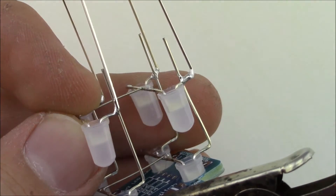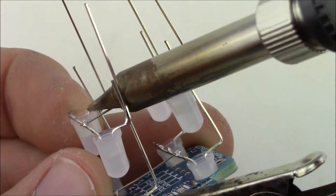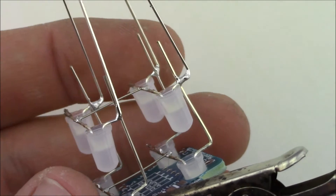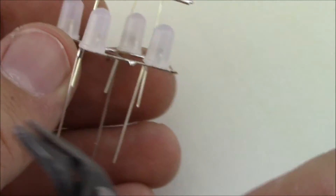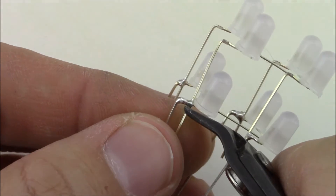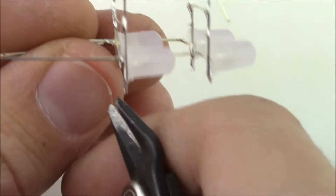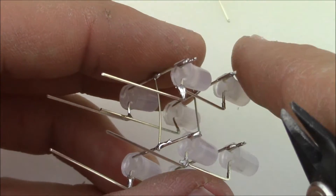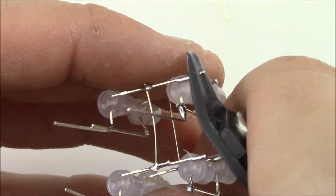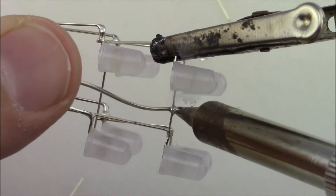Do that for all four LEDs — here are the front two done and the back two being soldered. It's a little finicky but not hard. Once four solder connections are made, if it's crooked you can heat up the solder and bend the LEDs to straighten them. Now trim off the little soldered bits with flush cutters, keeping the long leads intact since those solder into the PCB. Also trim off as much as possible of any bits sticking out to the side. Then move on to tinning the bus wire connecting each set of LEDs.